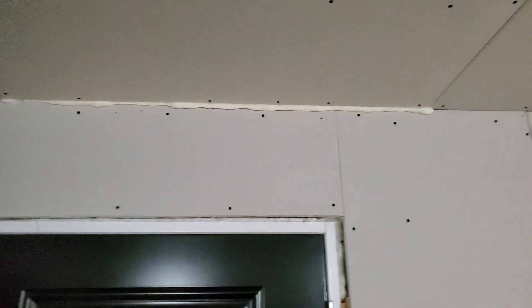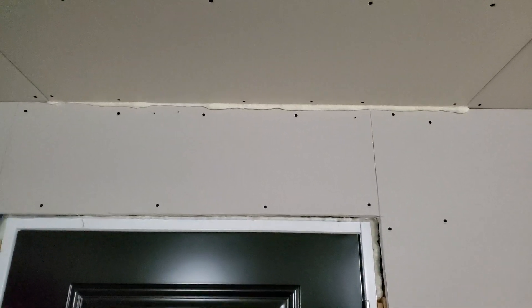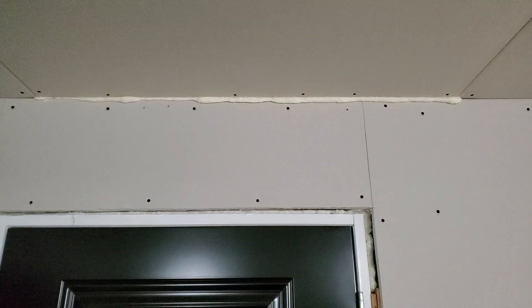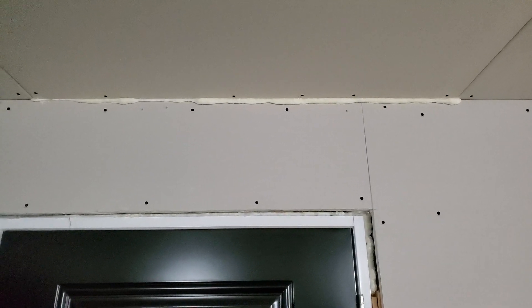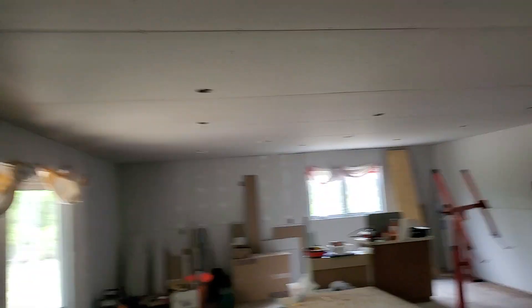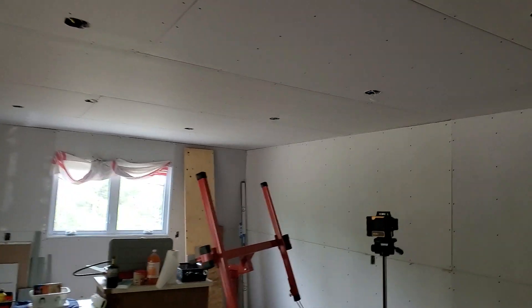Over here there's a bit of a gap — it's level, but it's kind of a little wave. I realized it's the drywall that had a wave to it. It wasn't a huge gap, but enough that I spray foamed it and cut it out. And when I putty it, I'm not doing so much fill with the mudding. Just a few little problems that I resolved with a little bit of spray foam.